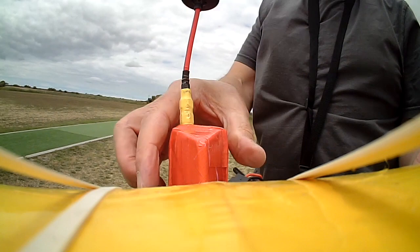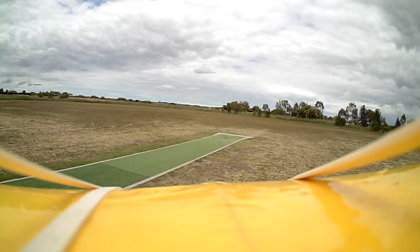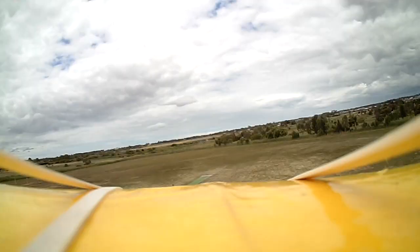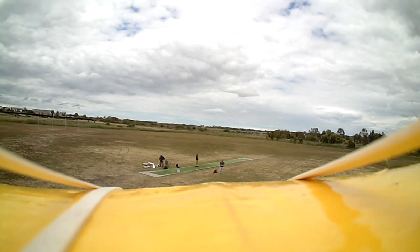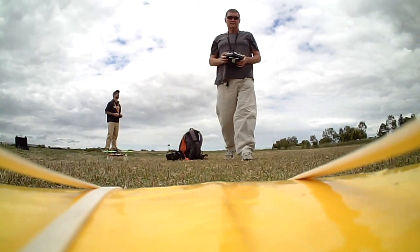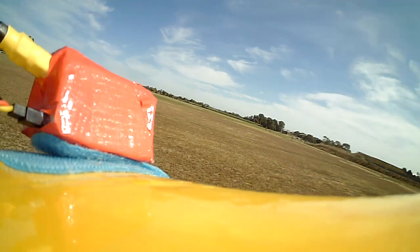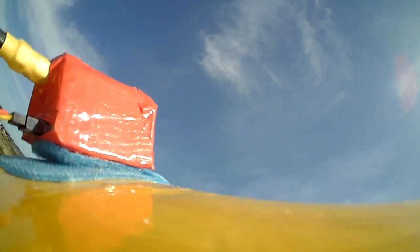There's my little removable FPV pod which I've decided to take off for the first few flights. I found that with the CG back a little bit and the throws at full rates it was almost uncontrollable — a real handful. So I had to move the battery forward a little bit, calm down the throws, and it started flying really nicely. It has an amazing glide slope and it works really well for close-in ripping around FPV — shooting gaps, doing a few aerobatics.